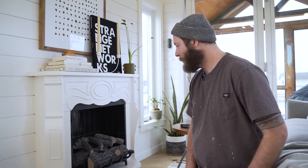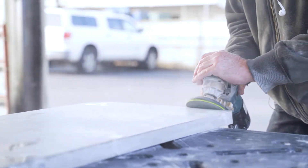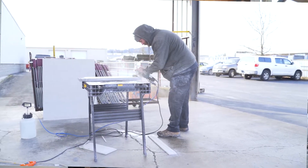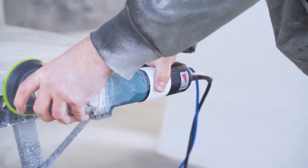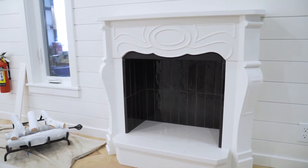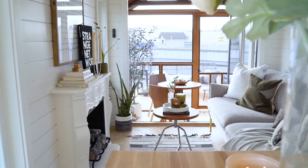This specific company, Terraflame, requires a 12-inch clearance off the top of the cans and eight inches from side to side, and we have just exactly what we need to make this work. We used a quartz hearth — quartz can only withstand about 300 degrees Fahrenheit before it could be damaged. The firebox is about three inches off and there's plenty of room for the heat to dissipate before it causes any issue.